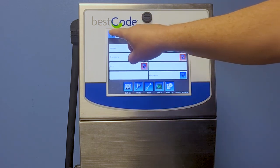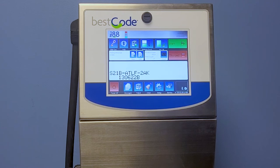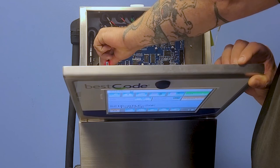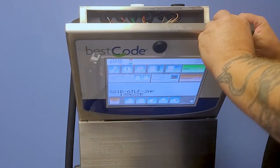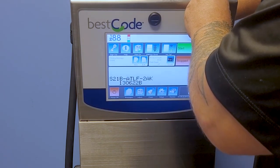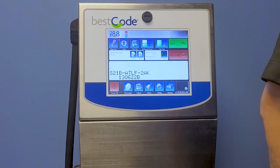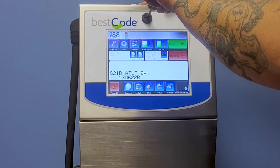And again, guys, just very briefly, if you're using a Model 88 or an 86 to restore messages, that will be fine. But you would not be able to restore three-line messages to a Model 81. And also, with the Model 88 and 86, we have faster and fastest. But on a Model 81, we don't. So again, when you're going to do a backup, make sure we are using the same models.